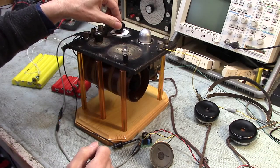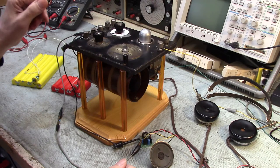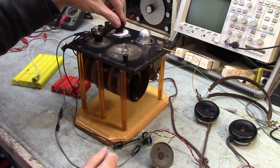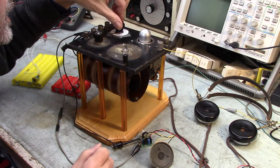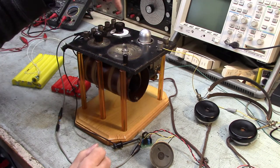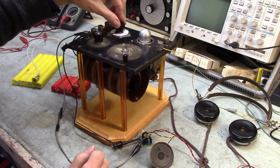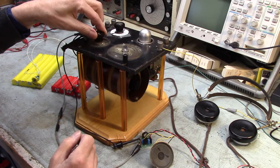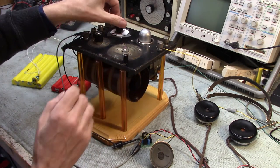That's pretty good considering I'm using the amplifier. With headphones on you can hear it really quite well, actually a little clearer. The amplifier does pick up a lot of AC noise but not bad. I can start to lose that station when I go to about 125 degrees on this little paper scale — then I start to lose it. The question now is how to get the tickler to actually do something — it doesn't seem to do a lot. Maybe if I went to a stronger station. The tickler does not seem to be particularly obvious.